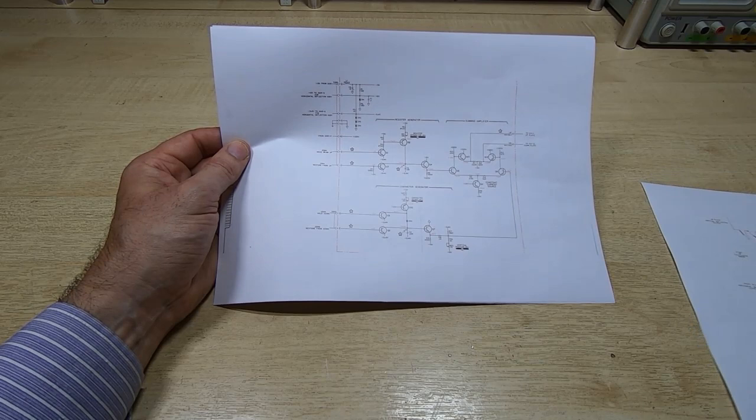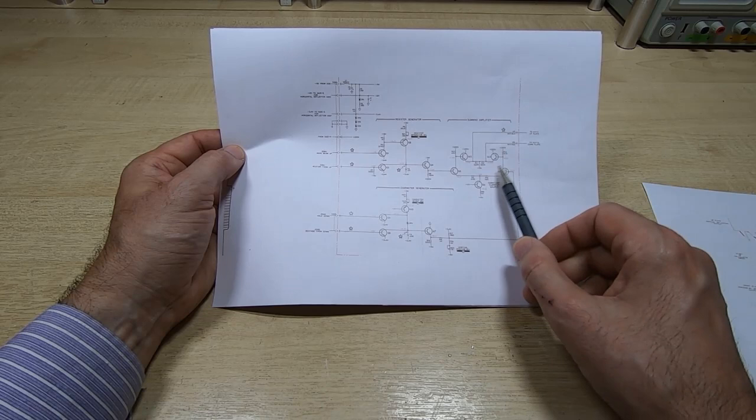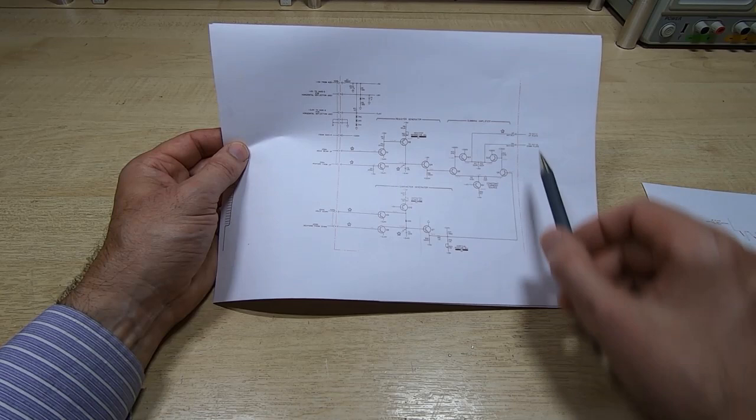It's the same thing with the register offset, exactly the same principle. It just moves from one row to the next. And then you have this summing amplifier, and it just adds these two together and turns this into a high voltage deflection. And this is kind of where the issue was. The problem on the power supply is in the high voltage smoothing for the 220 volt rail. And we'll look at that in the next video.